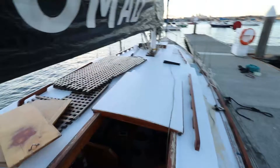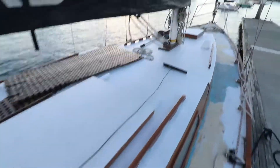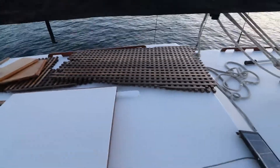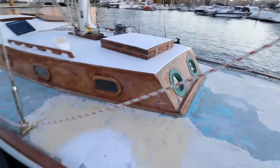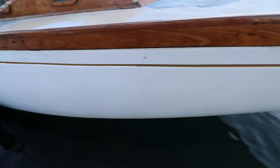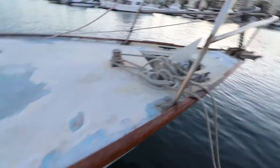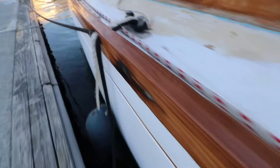I'll show you what I've already done. We can see some varnish boards where I went through the ply. The non-slip top deck has been done. The very slippery duck boards — I'm going to have to put a sand boat coat on those, or boat coat with non-slip. We're just coming back to trying to get back to bare timber so we can boat coat this. All the decks are still too rough — I've tried sanding those and it's not enough, so I've got a heat gun to get five mil of paint off. The very nose is done, and we've got a deck-oiled tow rail here, which is looking pretty nice all the way down.